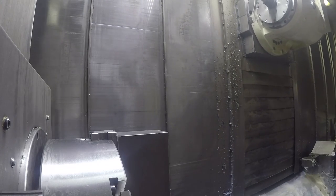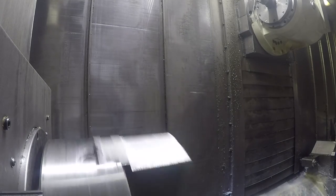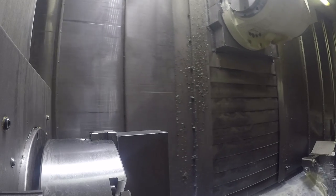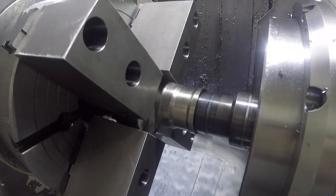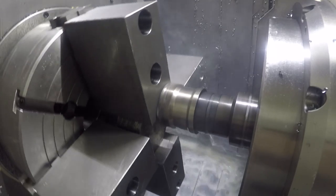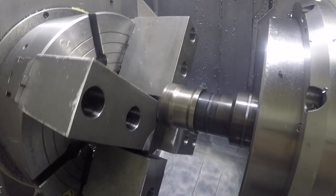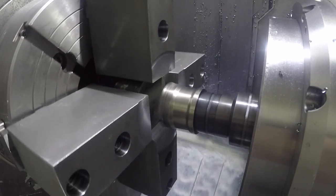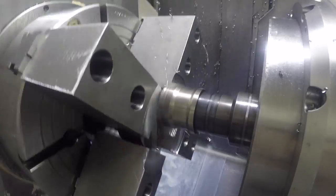But first I have to make some soft jaws to hold the part. So this part of the video is milling those soft jaws in order to hold the part on this first operation. I have to mill a counter bore for the 7 and 1/4 inch diameter, which is what I'm roughing out here with the feed mill. And then I have to mill between the jaws because I can't close them far enough to get the second operation of the part. I'm going to turn it around and use the ID of these same jaws to chuck onto it to do the milling operation, which is what the next video is going to be about. But in order to close the jaws far enough, I've got to mill the corners off the jaws.